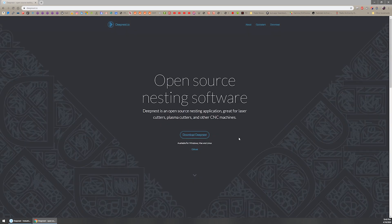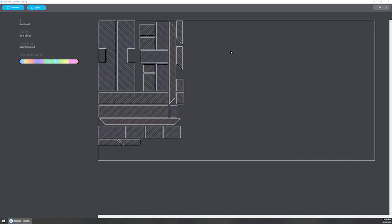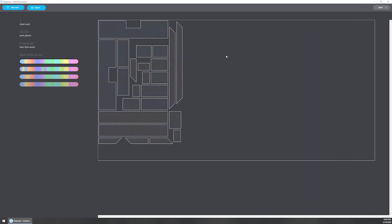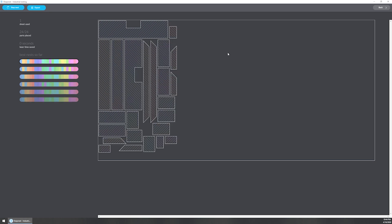We're going to jump over to this open-source free counterpart called DeepNest.io. It's pretty simple — not as advanced as ProNest by any means — but we're going to import our pieces as an SVG or a DXF. It says it can work with CDRs, but it doesn't seem to for me. We'll define the size of our sheet — in this case 96 by 48 — and hit a little checkbox to say that's the sheet. You can also change quantities of all your pieces there, and then it's going to start nesting. I'm running on a very beefy computer so this goes really fast on my editing machine; on a regular computer, this is going to take a minute. It's going to iterate a bunch of times and try it out. You can tell it the spacing to leave between your parts, how many different rotations to try — 45-degree rotations, 30-degree rotations, and on and on. I have it set to try and smash everything over to the left of the screen as much as possible, and that's exactly what it's doing.